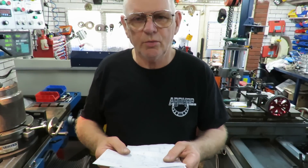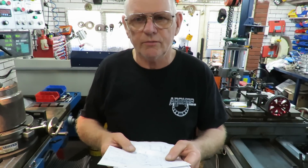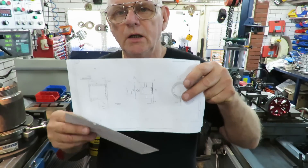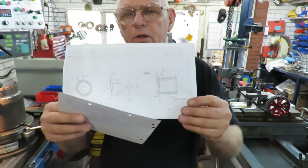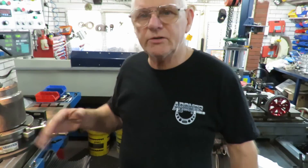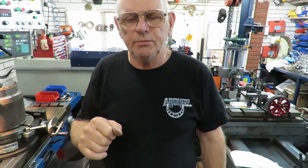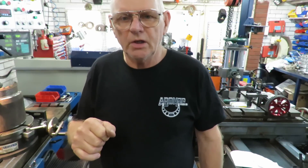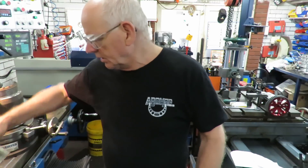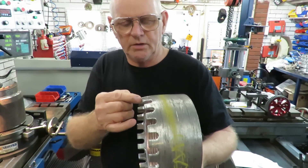I've got no coolant so I'm just working my way around - doing the first cut and then coming back to re-adjust to finish it off. I also have drawings supplied by the client. These drawings show the root of the tooth as being a straight cut, and I think this is the reason why they've sheared before. So I want to radius that bottom to give it more strength, and I can't see any reason why the bottom of the tooth can't be a bit radiused to give that extra strength.